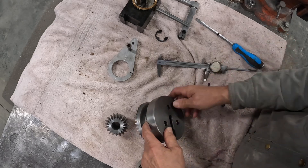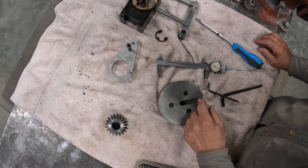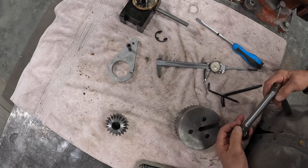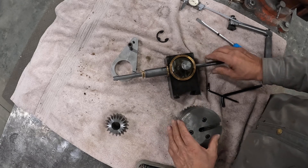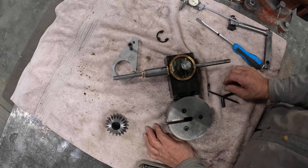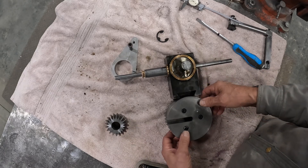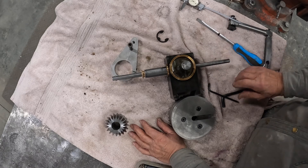This piece I made on top, and it's just held on to the root of the gear here. And I needed this slot in here so that I could put this on here. And this will determine the stroke — how far the business end of this thing travels. So as this turns, if I put this at zero, it's just going to sit there and spin and nothing's going to happen. But as soon as I move off of zero, it's going to start to move out every time it makes a revolution — it'll go out and then come back. The farther out I move this, the farther the stroke is on the cutting tool.